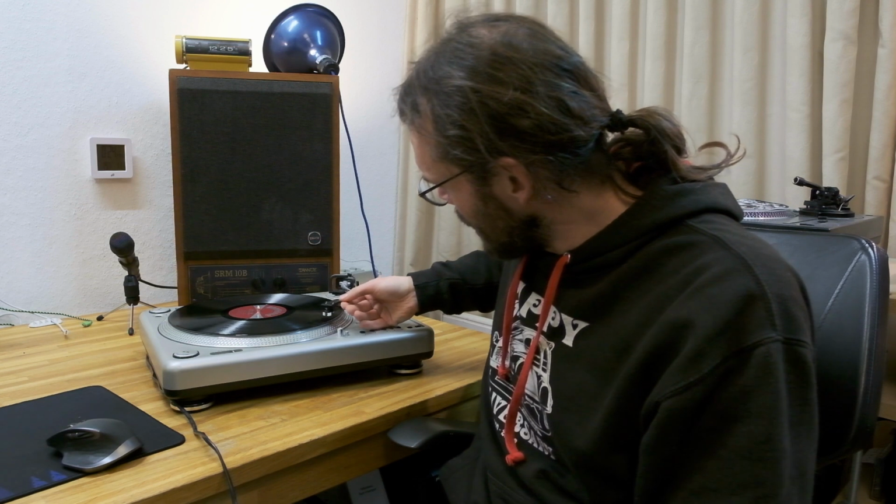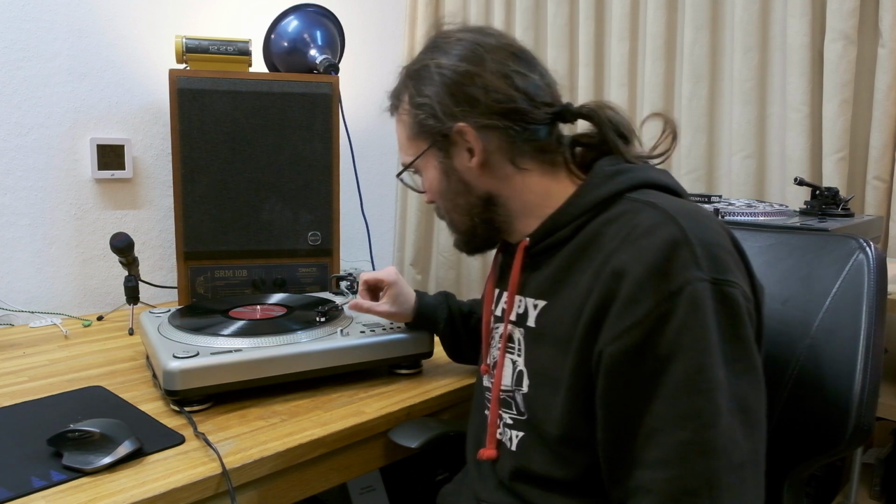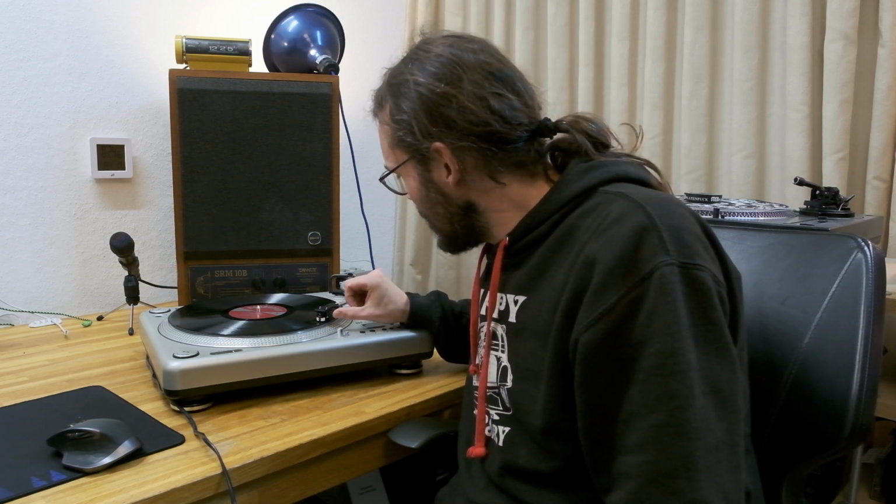Yet if I put the stylus on the record and I turn it, there's no power running the motor, but it sounds fine, other than the speed issues. This is because the actual sound amplification is not happening in the record player, it's happening in a preamplifier.